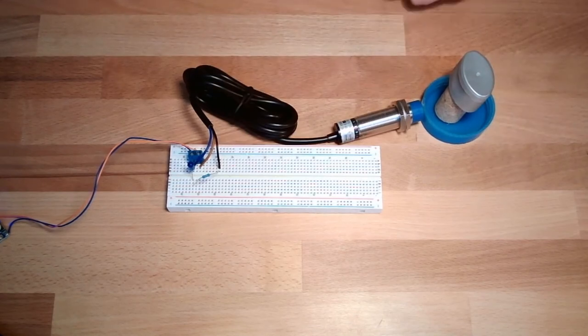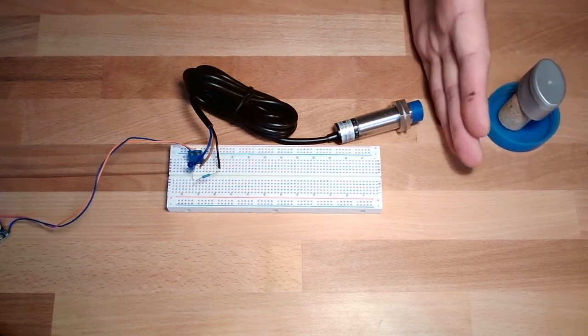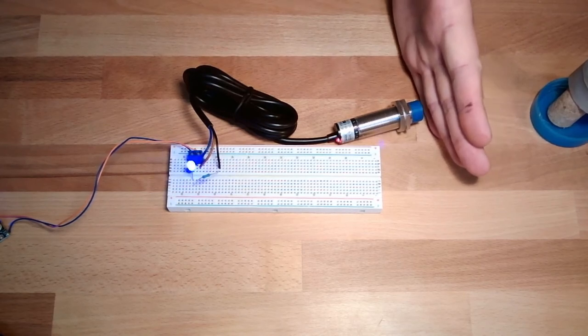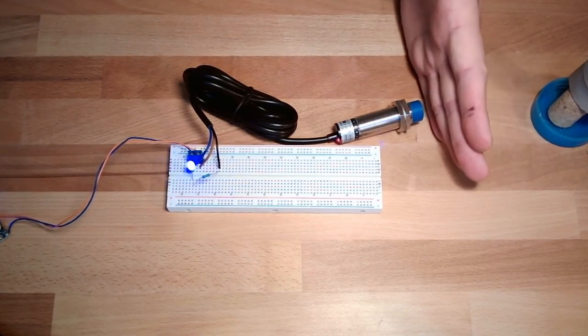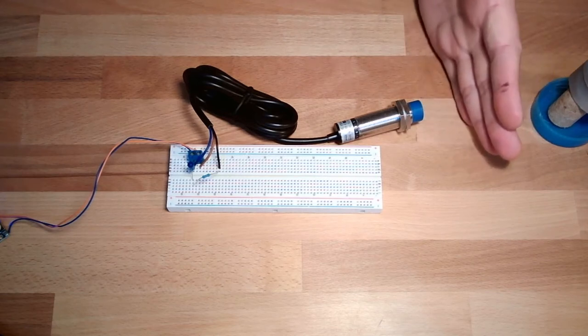That's a capacitive sensor, in German, Kapazitiver Sensor. There's also an oscillator inside. If some material changes the oscillator's capacitance, then the oscillator frequency changes, and the electronics notices this and switches. Depending on the material, it will also switch at different distances.